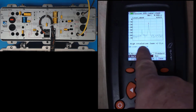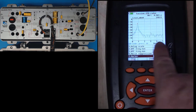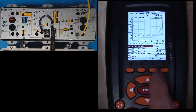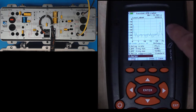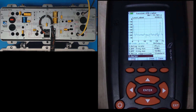I'm in the high resolution mode, so I need to go back to the standard mode. That's 5 microseconds. Let's change our scale to 25 microseconds because I remember seeing two CPDs there. I can see that my markers are bouncing back and forth between the two because they're basically the same level as each other. So let's go into a manual marker mode. With the right and left arrow I can manually change it. My marker is fixed on this peak at 23.102 microseconds, and it's roughly 9,998 feet away — almost 10,000 feet away.